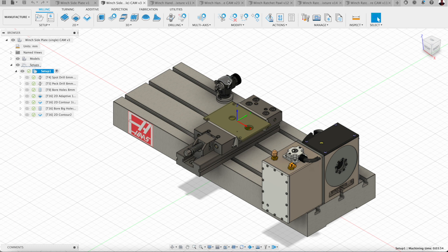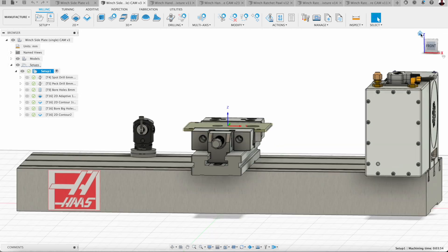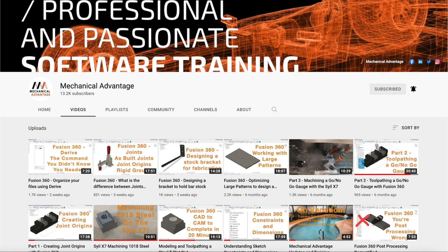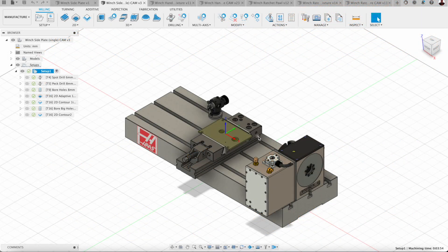The reason I do this is so I can have a bit of a look — it's not true crash detection, but I can just check it out while I'm doing the machining and make sure I'm not going to smash into anything. The other thing I like doing this for is because the part is actually below the vice. If you'd like to learn more about modeling your setups like this in CAD software or Fusion 360, take a look at my good buddy Kevin Ellingson over in his channel — he's made a video about making these parametrically linked in your model.